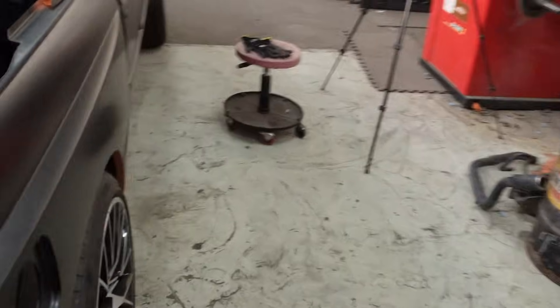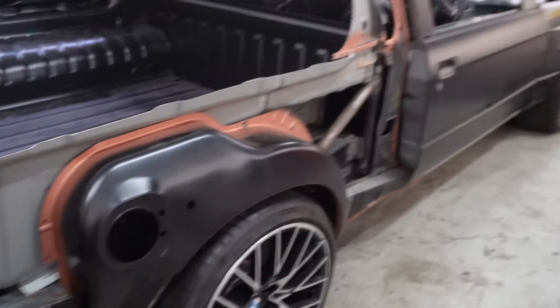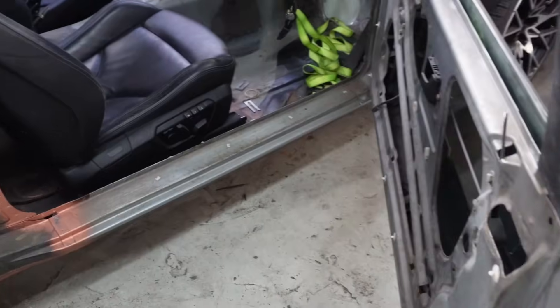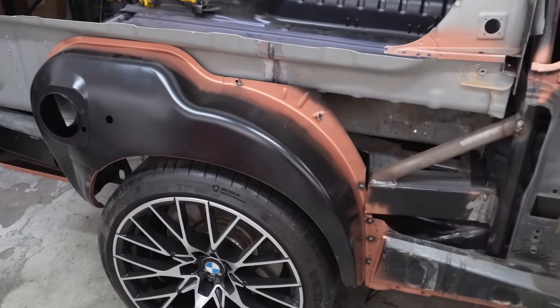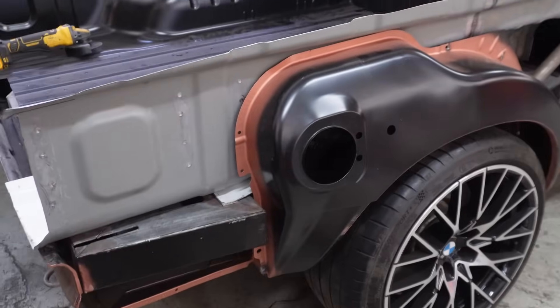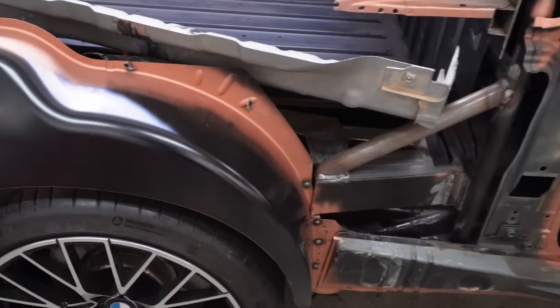It'll still look pretty good, and we should still have plenty of room to get the fuel filler neck in there — it goes down on quite a bit of an angle. I've taken off the rear quarter. After the last episode, a subscriber called Glenn — thank you very much for reaching out — messaged me saying that if the rear quarter isn't lining up or has a large gap where it's meeting the chassis, the wheel arch could be in the wrong spot. I'm always one to heed warnings, because if I don't listen, he'll probably be right. And even if I do listen, he's still probably right. So I think the best course of action is to mark out where it's sitting, take it off, get all the welds out of the way, and from there I'll have better access to make this inner part of the wheel arch — and it's probably in the wrong spot anyway.